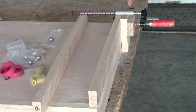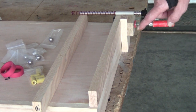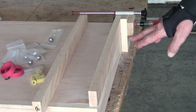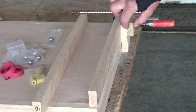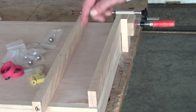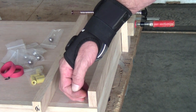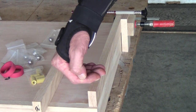Okay, came up with this design. I set the plunger across here. Now you noticed this has to be totally supported, so I got three pieces to support the guide for the plunger. The first thing I'm gonna do is take these two pieces and sand them down and round them, make them look good. Then I'm gonna glue the two together. The second step is to take this piece, put 45s on each end, and cut a rabbet out across here for the glass to go into.